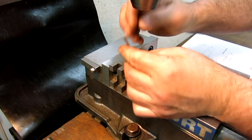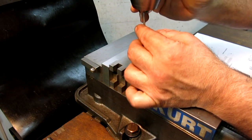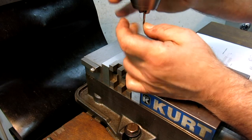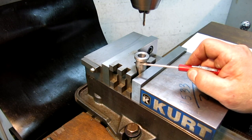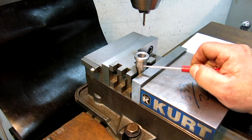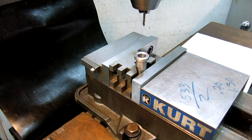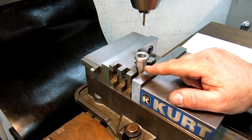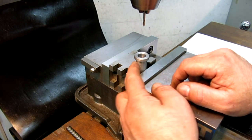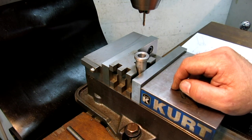What we're going to do, so we got to poke a couple of holes through here. And what's interesting in this is that the holes are going to go through this flange, but there'll be half a hole in this wall and half out of this wall when we come through. So what I'm hoping, and we're going to go for it and try it, is that we can just do it with the drill and we won't have to come back with the end mill. So this is interesting enough. I'm going to zoom in and get up nice and close here so that we'll see the first one and see how it works.